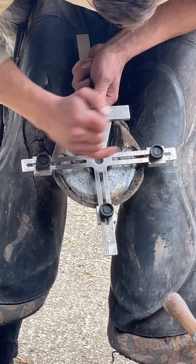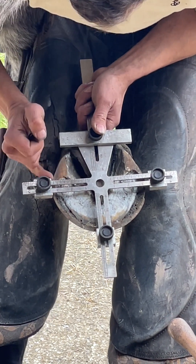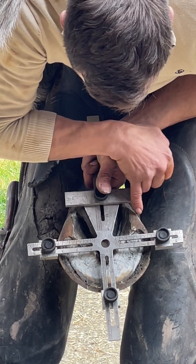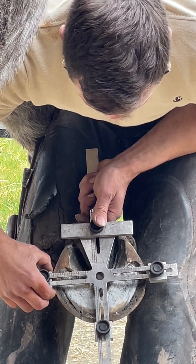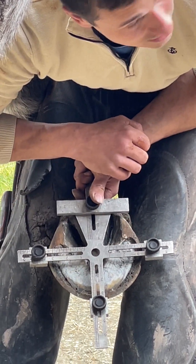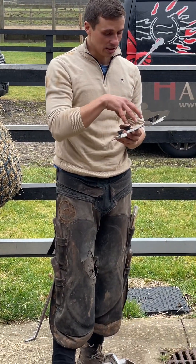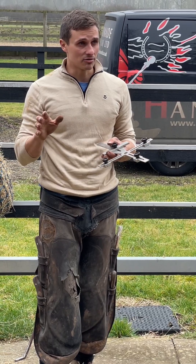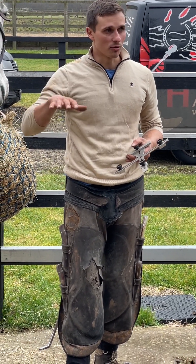Moving on to the actual heel aspect after we come through our quarter. The medial quarter is about an inch and a quarter long - quite nice and sharp. And then this outer border coming into this heel, where that inch is going to sit, it's actually very straight. We can commit to that because it's easy to understand from breaking down this small portion. The lateral one is exactly the same, but the quarter is a bit more longer and swooping. So if I put a tight quarter in there the same as the medial side, I'm actually probably going to end up coming under my toe quarter a bit. So I want to make sure I put that slightly longer, and that's going to help give that little bit of lateral support that this foot needs. That's helped me break that foot down. So now I've got this set up to that foot, I can make my shoe inside of it and be confident that as long as it hits all those markers, it's the right size and very close to the right shape. It gets you very close, and then you're going back for one, maybe two hits here and there rather than another whole heat reshaping it. And you're taking your burn time off the foot - the more times you go to that foot, the more times you burn, the lower it's getting, and then you start panicking.